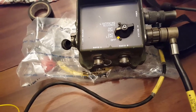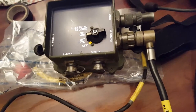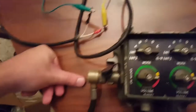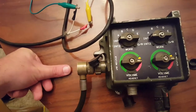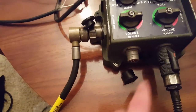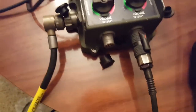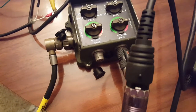Direction is important when it comes to the interconnect cables on these systems. Here we have a CX13473 connected to the station in accordingly. The other end of that CX13473 needs to be connected to the station out on the crew box. This first crew box is a light crew box, meaning it's two positions — two users can connect headsets here. We only have one connected here for demonstration purposes. They're connected through a bailout cable that then connects to the headset.